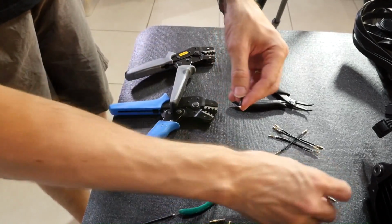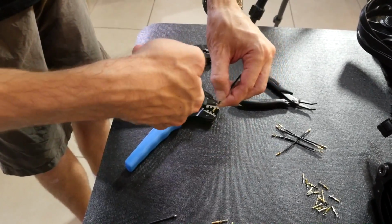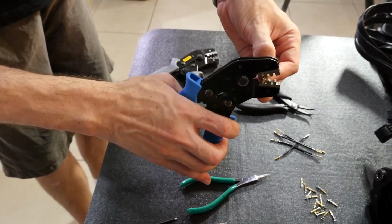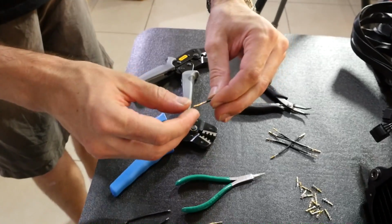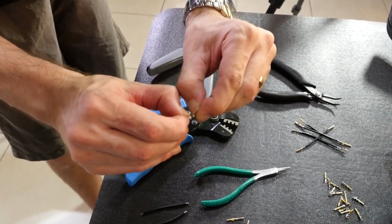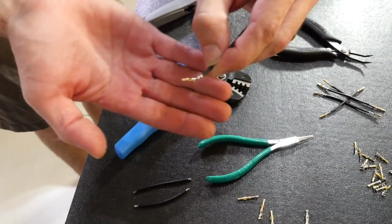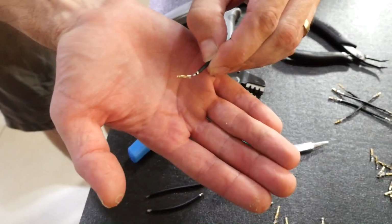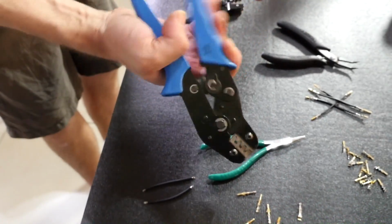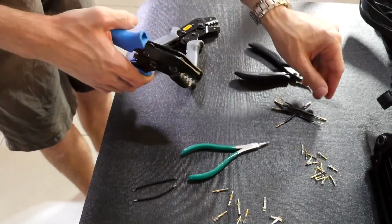You know, even just smashing it down. Normally when I smash it down like that on these other crimpers, it goes too far and it bends the pin backwards. Like, watch this. Oh, it's not too bad, that one. But yeah, normally what happens is it ends up like that. Yeah, hold on. Because it's too much pressure. I mean, I am super used to these, so I can always get a good result, but it's really easy to actually compress it too far.